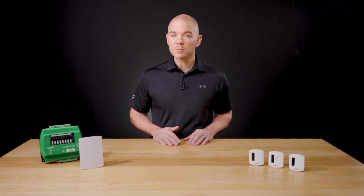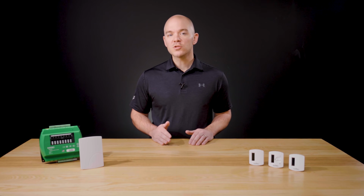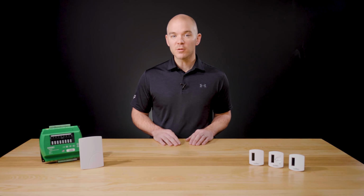The next factor is what blocks the path of the signal. While radio waves can move through walls and other materials, the strength does decrease. And depending on what the obstacles are made of, the reduction can be significant. Wood, glass, and drywall have relatively low reduction, while metal, iron-reinforced concrete, and mirrors have significant reduction.